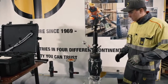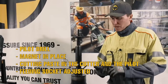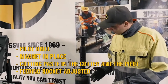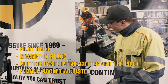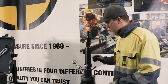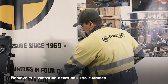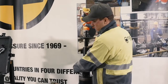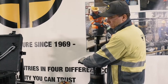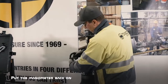We have the pilot drill, we have the magnet in place, we have the cutting paste in the cutter and on the pilot, and we have the feeding socket adjusted. So the next step is to remove the pressure from the drilling chamber.